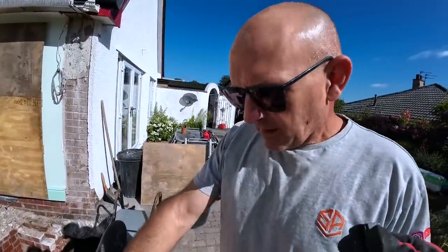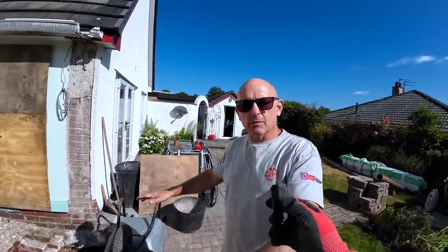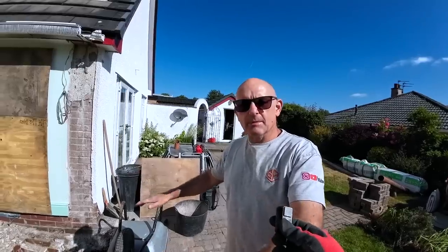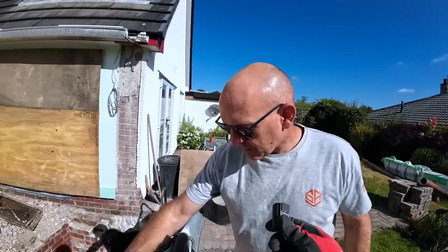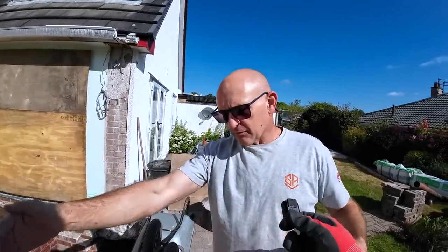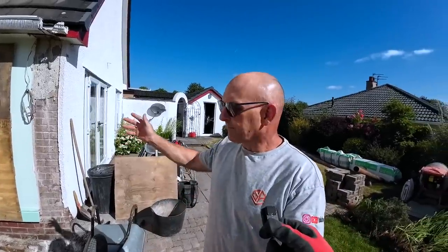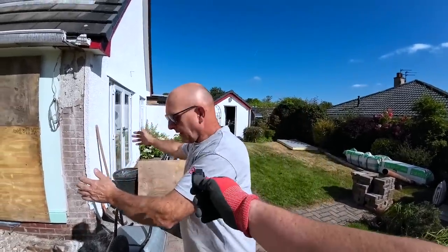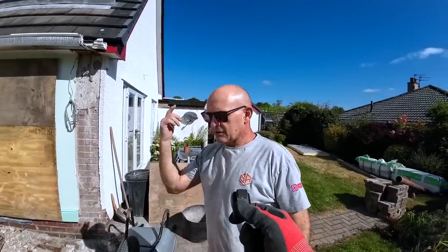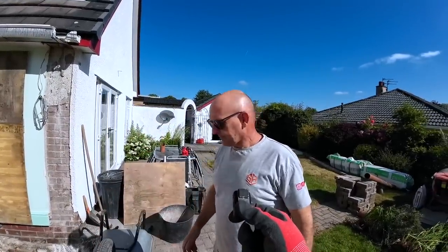Oh yeah, quick one. It was 300 mil of concrete, reinforced, but it wasn't very deep and it was on a load of rubbish. So he'd gone to all that trouble of reinforcing it, but he hadn't gone deep enough with it. As you can see, we've gone through the crap into the clay, and it's 650 minimum wide, some of it's 700, so it's got a really good spread under the foundation. And it's got a block pillar, 4 metre opening, block pillar, solid block wall. So it's just two walls and a door, really, a big door.